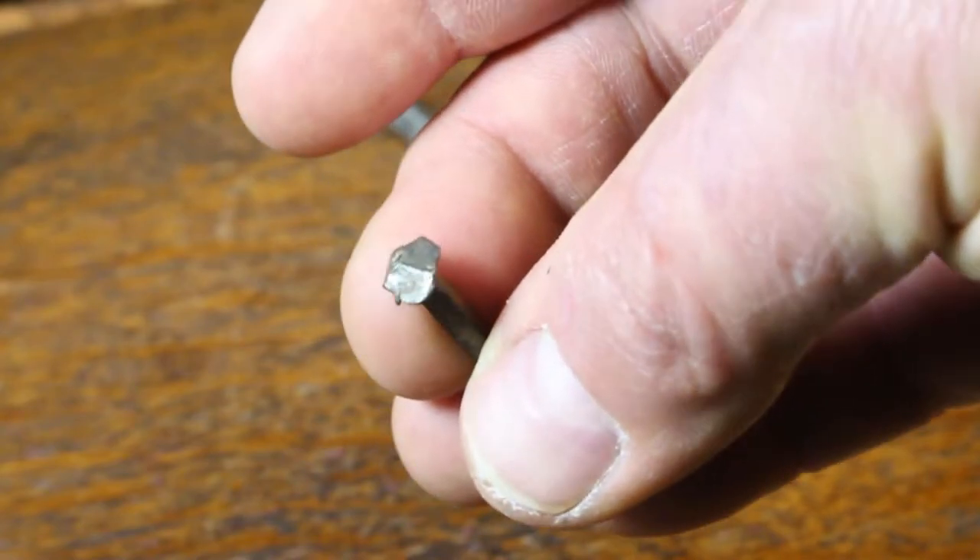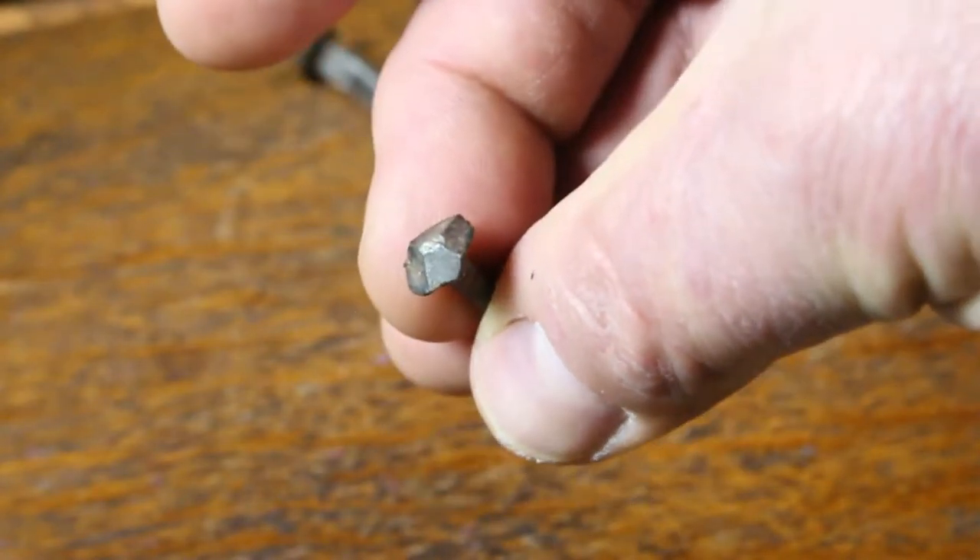It could be headed in a number of ways. The most common are these rose head nails, where it was struck four, maybe five times, creating what's called a rose head. There are variations of this nail, both in the way it's headed and in the tip. Rose headed nails are the most common — you'll see those used in framing, maybe even board and batten doors, and things like that.